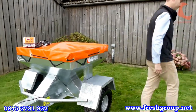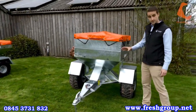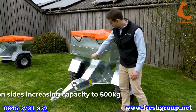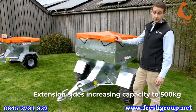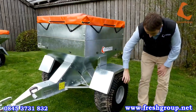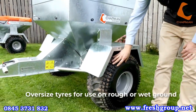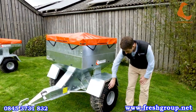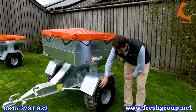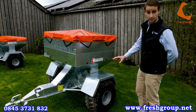Moving to the second machine — this is the specification we'd sell for feeding cattle at grass, especially during summer or autumn months. It's based on the same basic machine but with extension sides, which increases capacity to approximately 500 kilos depending on the feed, and oversized tyres. Because of the extra weight, we recommend the oversized tyres — they tow easier on rough ground, and some users spec this option in winter on very heavy, wet ground. The oversized tyres replace the standard 22x11x8 with a 25x13x9 flotation tyre, and these are interchangeable at a later date.